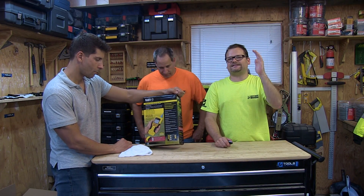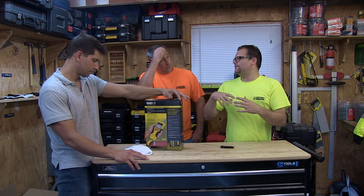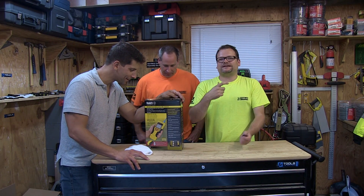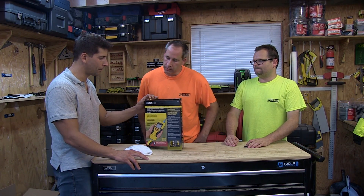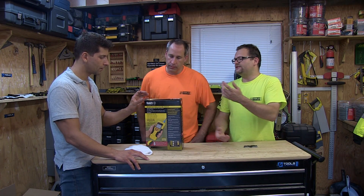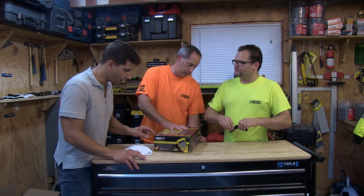Pretty much this is to find out the pin numbers and your ports, so you can find out your jacks. If you have a house with five jacks in it, you go down to the network point and say okay, Eric's room is jack one. If jack one's got a problem, you can test it and map it out. It also shows fail, short, split, open, and distance to fault.